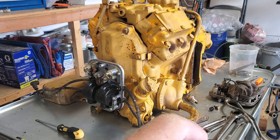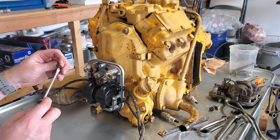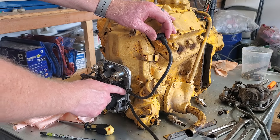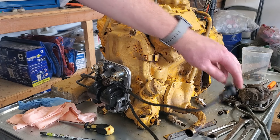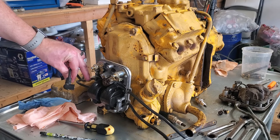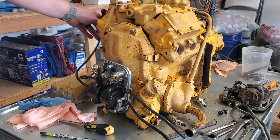We've got to tighten those screws up. When we're putting these screws in, we tighten them so they're just snug, but we still want to be able to rotate the distributor. While we're talking timing, we should also talk about cylinder wires. The top right cylinder wire coming out of the distributor goes to the front right cylinder — this is piston number one. Bottom right goes to the back right. Same thing over on the left-hand side: the top left wire goes to the front left cylinder, and then the bottom left spark plug wire goes to the back left cylinder.